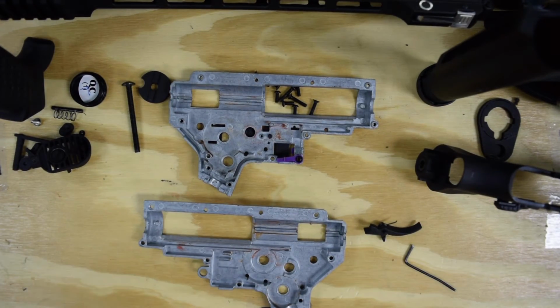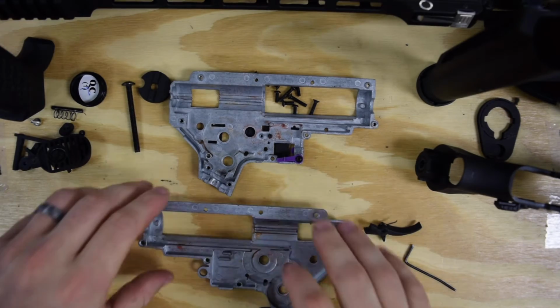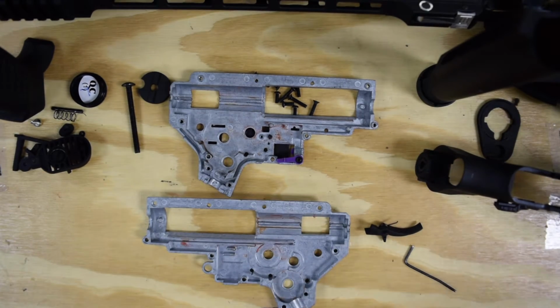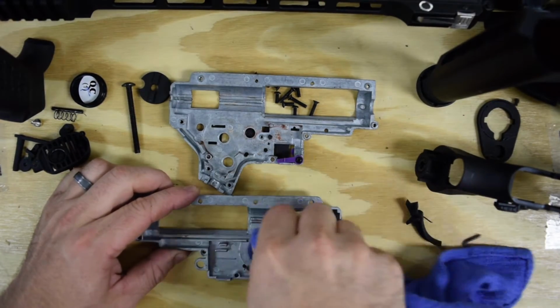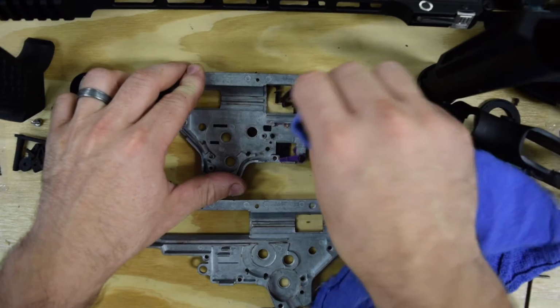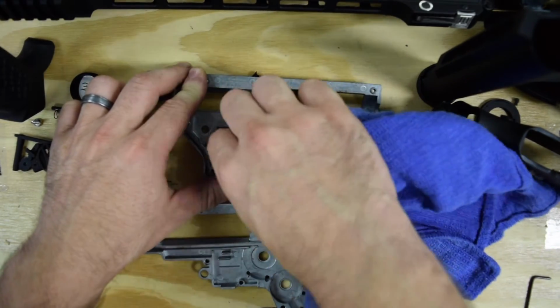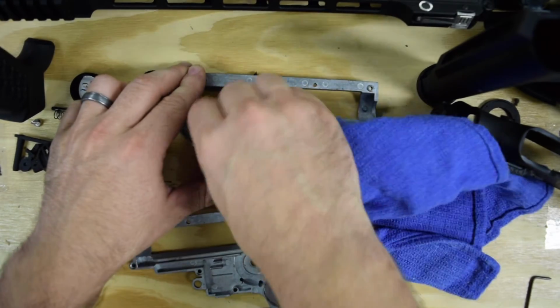If you want at this point, you can go ahead and wipe some of the grease out of the gearbox if there's a lot. Doesn't really hurt anything. Generally cleans up the installation, so we'll go ahead and do that. For that, we're just going to use a rag with a little bit of acetone on it. Not worried about getting every last bit, but just get the majority of it out of there so it doesn't gunk anything up, make it greasy.